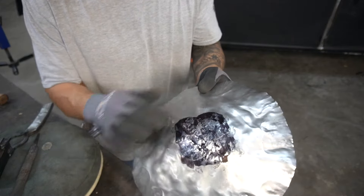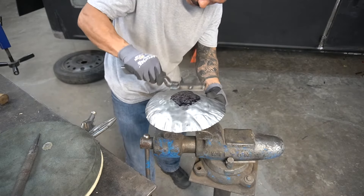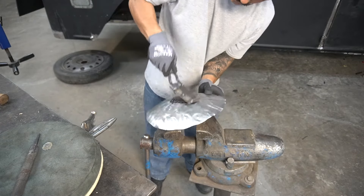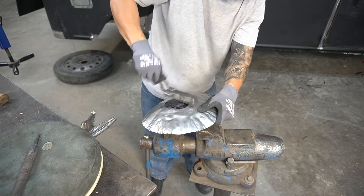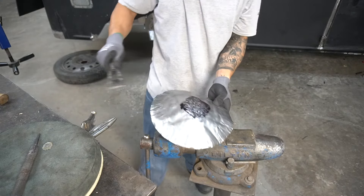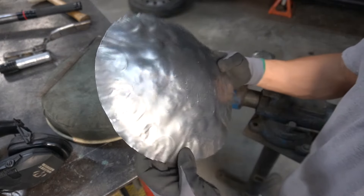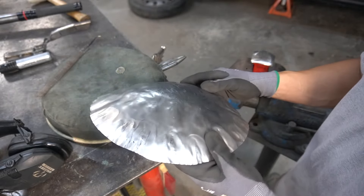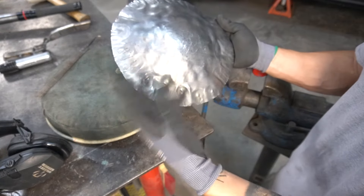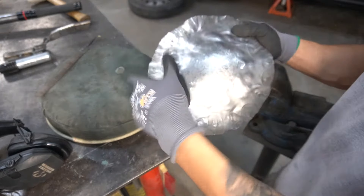Now you can see we're a lot closer with our scratches. We've got some lows in here, let's keep hitting those. Now that I've cleaned off that Sharpie, you can see the top of this is planished pretty good. I'll do that to the whole panel with that slapper hammer and dolly, but I haven't got all night and neither do you, so let's jump to the English wheel.